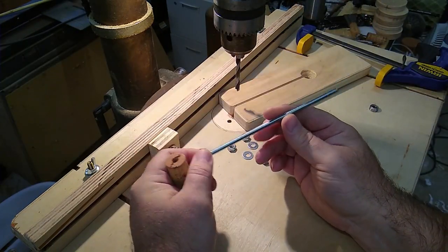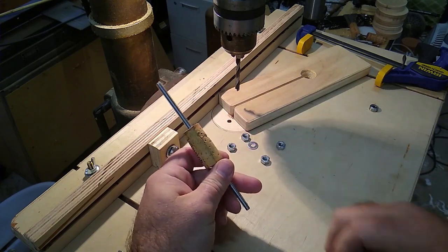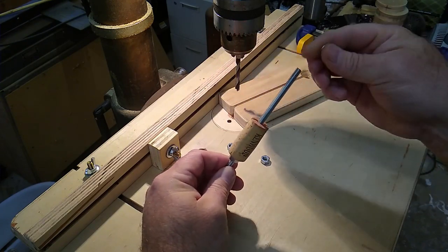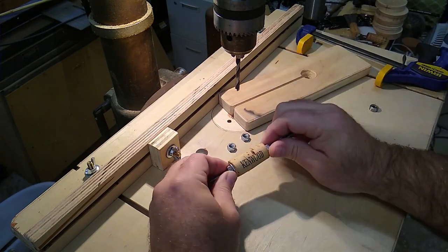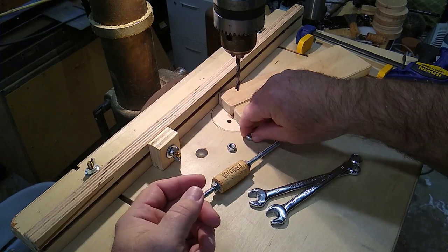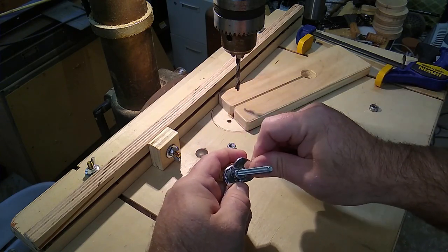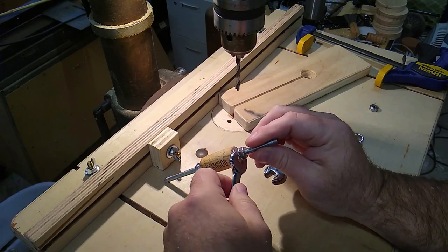The second function of this jig will be to carry a bearing in the other end of the board, in order to prevent a mandrel from being deflected while you're sanding on the cork. I'm using a short length of threaded rod. To reduce slippage of the cork on the shaft, I'm going to install a washer on each end and two nuts used as jam nuts. I want to tighten the first nut on each side down onto the cork snugly to push the washer into the cork and cause a little friction at both ends. Then I'll put a jam nut up against the first nut and use two wrenches to lock the jam nuts in place.